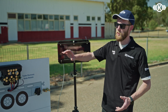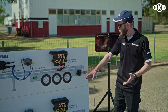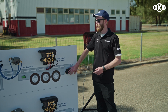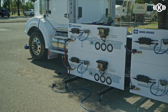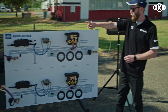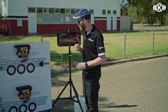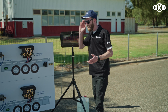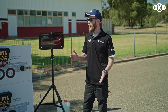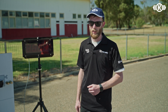Once we've run through a few tests, we'll set up the whole combination as a full six-axle group road train. We'll connect the rear couplings of the A-trailer to the front couplings at the bottom and measure control timing from the input at the headboard to how long it takes to get to the sixth trailer down the back. We'll do that both powered and unpowered to show the timing difference, and convert that timing into a metre distance if the combination is travelling at about 100 km/h.